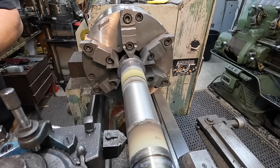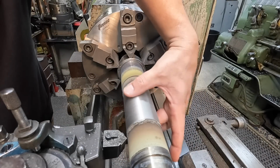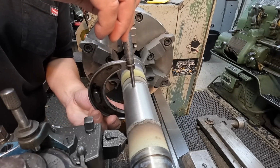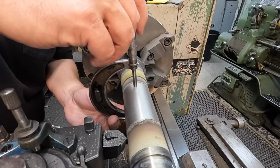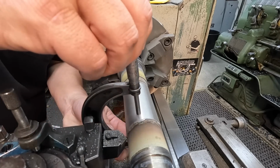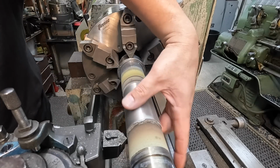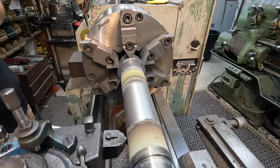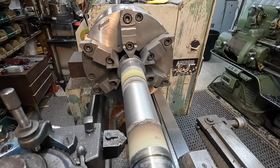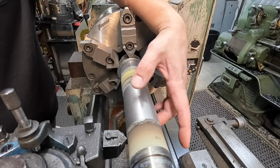That was two roughing passes at 20 thousandths per pass. I just do this to try to get the dust off of it. It should put us within 20 thousandths of being the size. 2.029 and 2.029. And we're looking for 2 inch, 8 thousandths of our finished size right there. So that's right at, what's that? 19 thousandths. So what we'll do from here is make a couple finish passes across there.